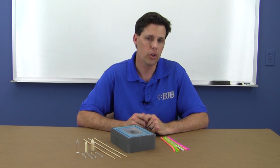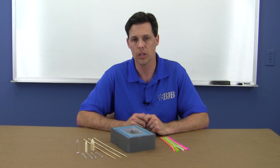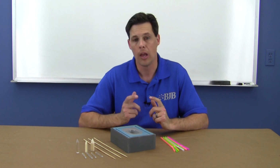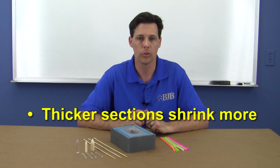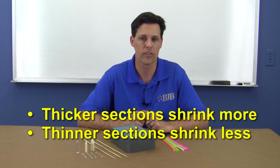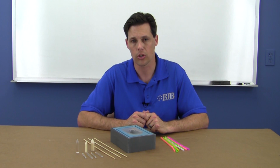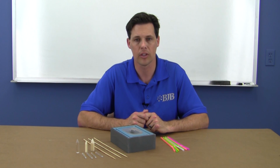As casting materials cure, they do exhibit varying degrees of shrinkage depending on the formulation and the actual mass of the part. Thicker cross-sections naturally have higher shrinkage and smaller sections will have less. The makeup material in the reservoirs will help feed the part as it cures and prevent issues with material starvation.